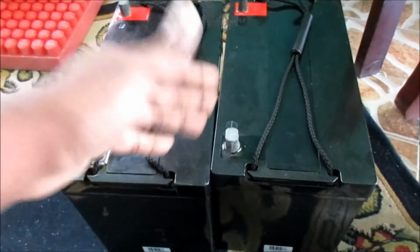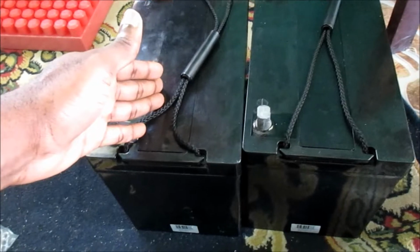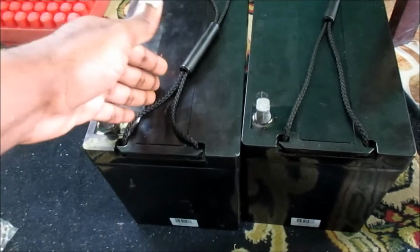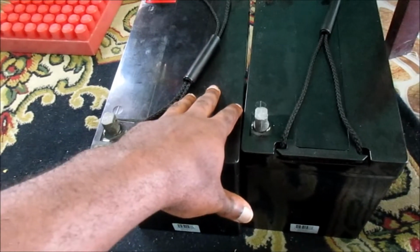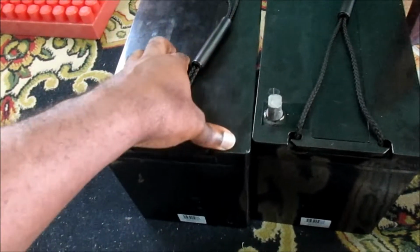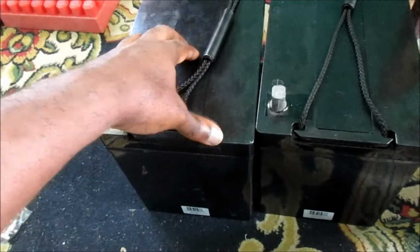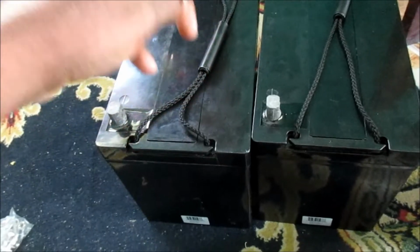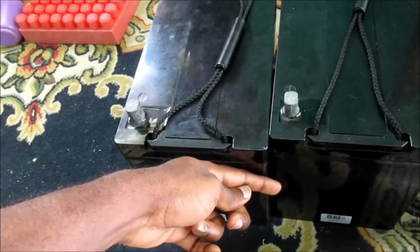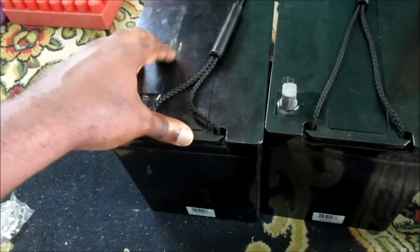We have two batteries here, but if we only had one, when this battery is dead, the two of them together will be at 50%, because this is 100, 100. So instead of using one battery, we use two. We get 50% discharge instead of killing our battery completely.